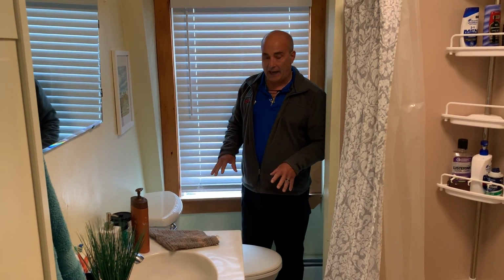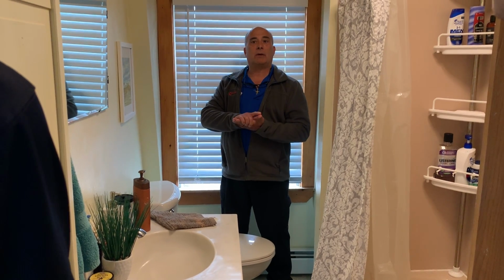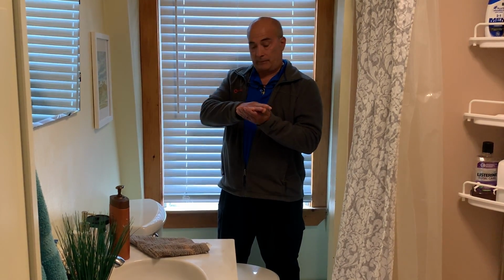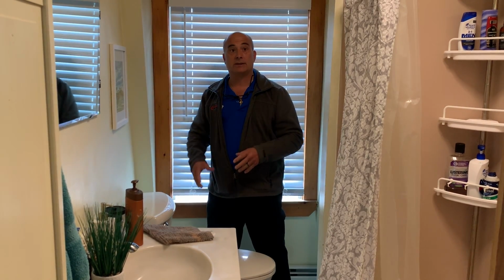Now, when you talk about that, let's say this toilet was loose, you can say, and I think Bryce talked about it, a pull and reset. What's underneath there is a gasket. This is where you explain this very clearly to the customer. Under this toilet is a flange, and there's a gasket that sits in between the toilet and the flange that makes the seal. When that gasket starts to wear out or the bolts loosen up, that's why this toilet is wobbly right now. Now, any leaking downstairs? They say no, good. That means the wax is still in place, but not for long in this condition, because every time somebody sits on this, it's causing that wax to loosen even more.